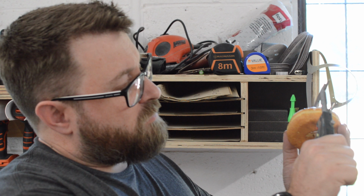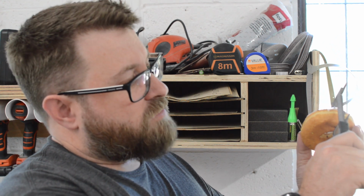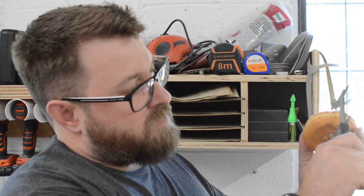I've got to have 2 of them. So I was going to use 3-inch dowels, so I think I'll be using 3.5-inch dowels, which will give me enough to go into the backing board and a piece to go out the front. I might even go for 4-inch because then I can round over the front piece. Be rude not to.